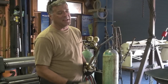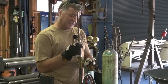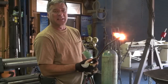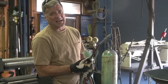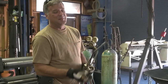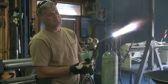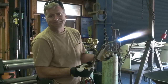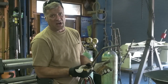Another problem is people like to open up the acetylene just barely — just enough to where it just barely wants to light. Then when they hit the oxygen, it'll pop like that every time. But if you open up your acetylene properly and then go ahead and adjust your oxygen, no problem. Turn your oxygen off, turn your acetylene off — no problem.